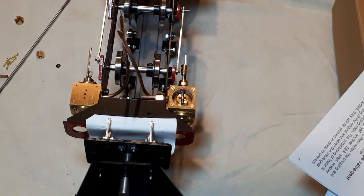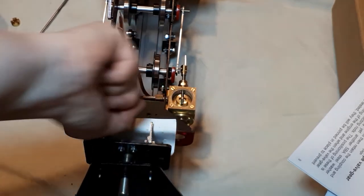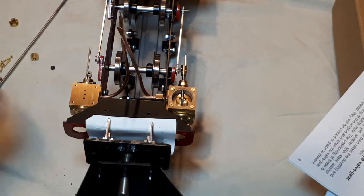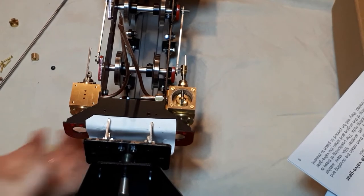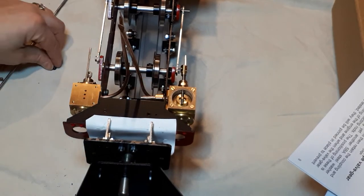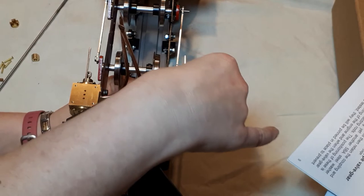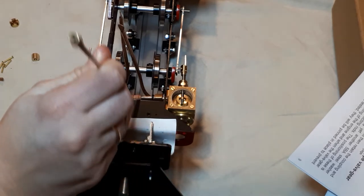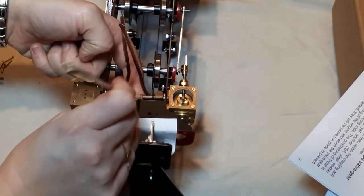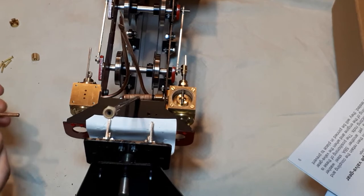So again, because it doesn't hurt the engine, I am just going to put a little bit of Vaseline on the end of there to help put that on. I'm putting too much in there, actually. So I've put the nut on. To get that O-ring on. Oh yeah, the Vaseline definitely helped on there. That superheater needs to go on there. Now I've pushed it all the way around. I'm not going to tighten it all up until it's all together. So I've got that one there.